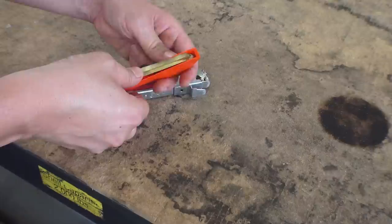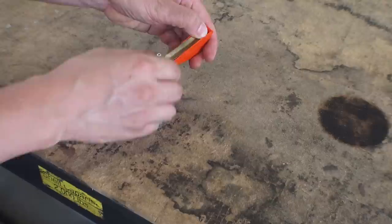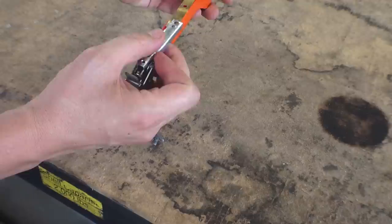Set the new bulb in there, then get the brass holder to hold that in place. Make sure you bring your wire around — it's got to tuck into the bottom of the lens. It can be a bit finicky; you almost need an extra set of hands. You've got to pull up the semaphore arm from the unit, and it has to go below the brass piece on this particular model.